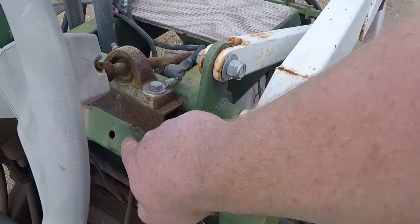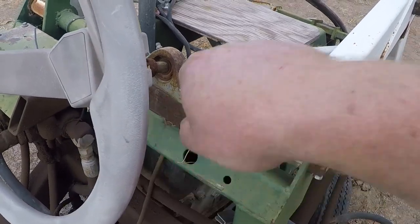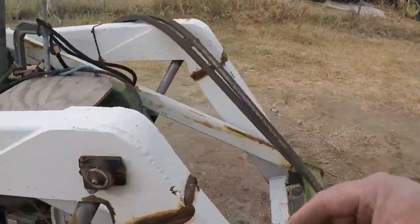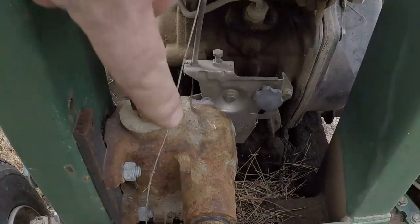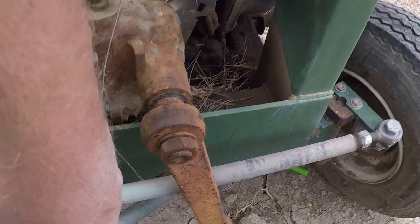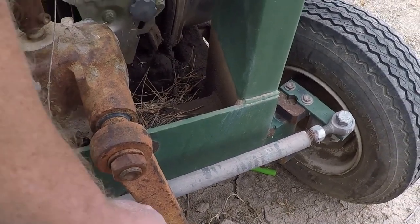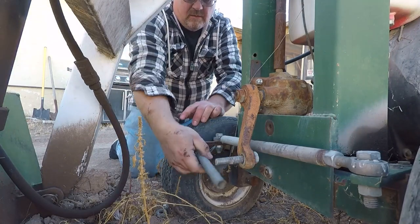Here's a leftover of my original steering system that didn't work. I had a gearbox mounted here, going straight through and down. The first steering box really didn't work well. Then I modified it, and now it goes from the steering wheel, through a U-joint, to another U-joint, to a Chevy Vega box, which goes to a tie rod, which I recently broke. First thing I do is take off this broken tie rod. Alrighty.